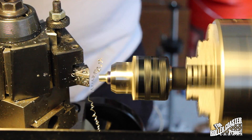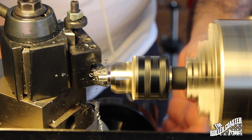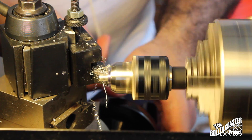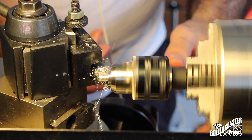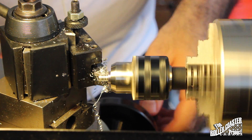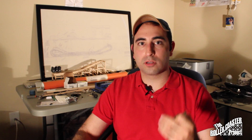The really clever thing was that for the right side of the car we use right-hand threads, and for the left side we use left-hand threads. We had to get different dies and different taps, but because of that, as the car moves forward — which is the only direction it's going since there's no rollback — it's going to tighten the thread, helping the bearing roll the car forward.